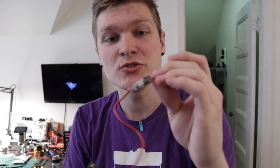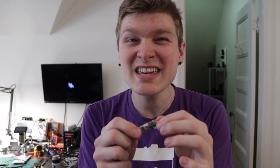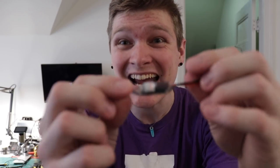So instead, I'm going to use this guy. This is a 5 volt regulator. It's used on drones. It's really noisy, so it doesn't give you a very stable 5 volts, but it can put out like 3 amps or something, and it's really tiny. This is pretty much a really awesome buck converter. It'll take a higher voltage and step it down to a lower one. So I'll take my power supply, I'll feed it into this, I'll get a whole bunch of juicy 5 volts coming out the other side, and then my Arduino can rest easy, not trying to power the entire servo motor by itself.